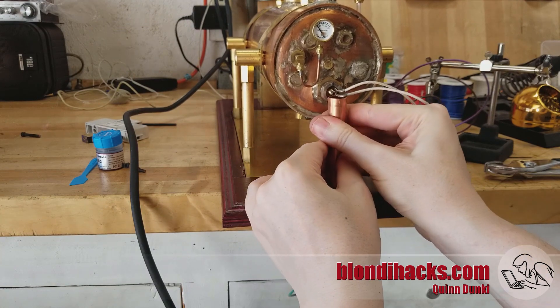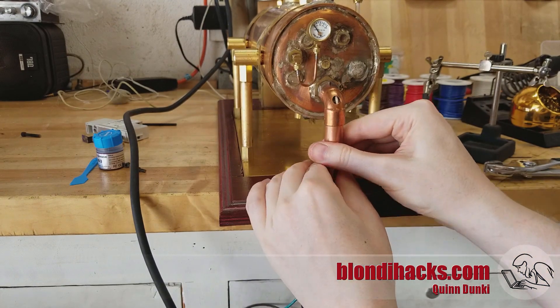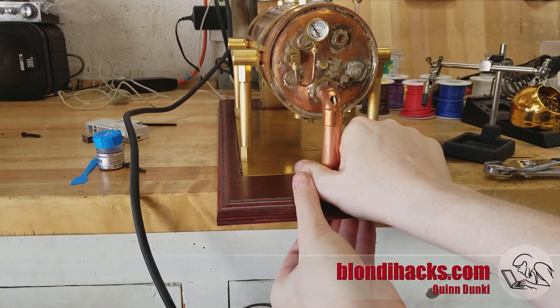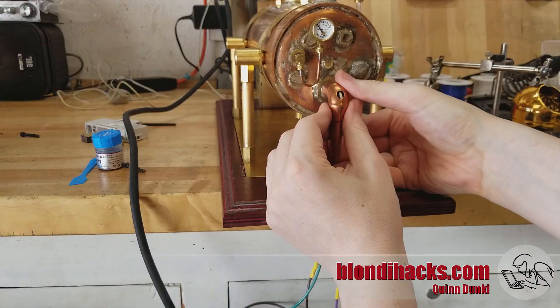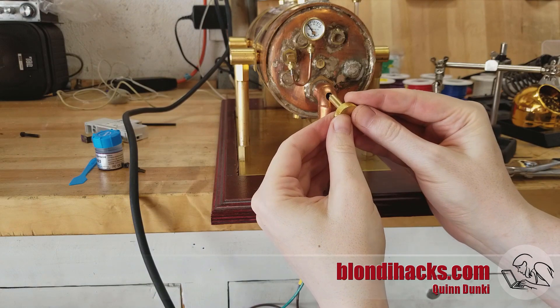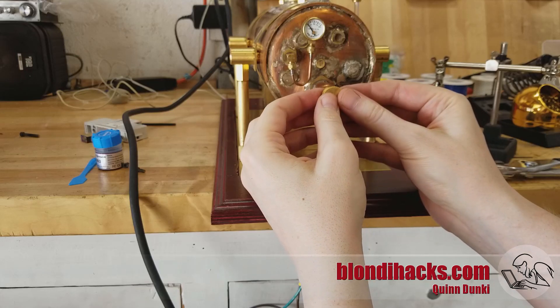Every single metal part on the boiler is grounded, which is very important because this is basically a toaster in a bathtub. So that's a nice press fit in there so that it can be removed. The elbow goes on there to hide all the wiring. And then once we get that all shuffled into place, alignment is pretty important because that hole has to line up with the thermo switch adjuster screw. And then there's that brass knob that you saw me make in a previous video — that slides right in so we can make the pressure adjustments on the boiler.